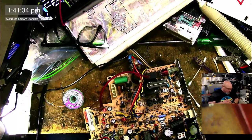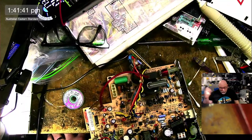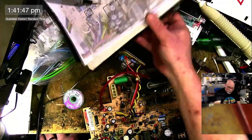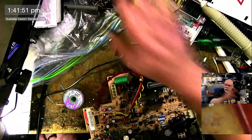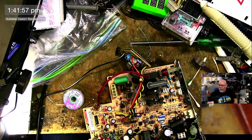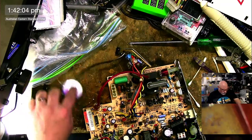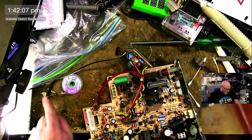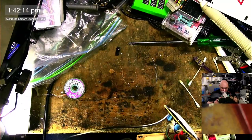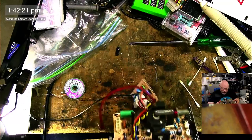I've got an LC575 analog board. If there's anyone out there who's good on CRTs, because I'm not, I'm crap at CRTs. But anyhow, this analog board is producing the right power output, sound's working. So when I put it in there and I switch it on, the computer chimes and it'll boot. But the image is just squiggly lines and it's not good. I need to try and figure out what's wrong with it. I have recapped the obvious, the most commonly bad ones on those boards, but it's still the same, made no difference at all. So I'm going to have to do actual diagnosis on that now. And I hate that sort of stuff. I hate working with those high voltages. I don't like it.